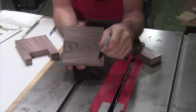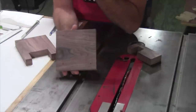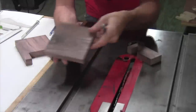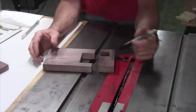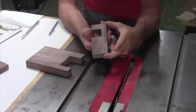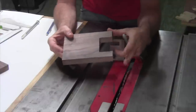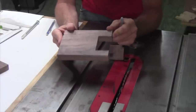We still have to drill four holes that match the mounting holes on the back of the TV, and then there's some other work we have to do with this piece. The other two pieces are going to create the pivot arm — the main bracket and the pivot arm. The main bracket is four and five-eighths inches long, two inches wide. The pivot arm is four and five-eighths inches wide, six and a quarter inches long.